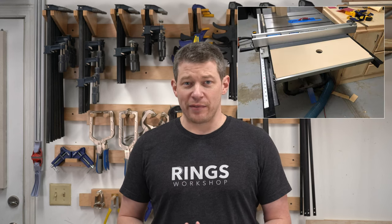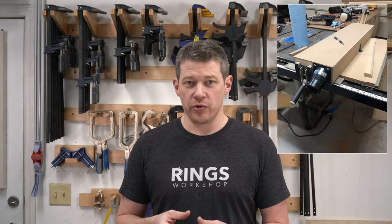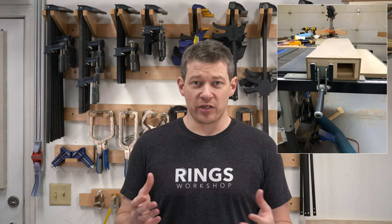On the Delta, I was able to mount the router table right in the extension wing. I was also able to use the table saw fence to support my router fence, and that was the same idea and first plan I had for this as well, but I quickly ran into obstacles there. First was because the extension wing was 36 inches on the saw stop versus 30 on the Delta. I was quickly running out of room, which I already didn't have a lot of,